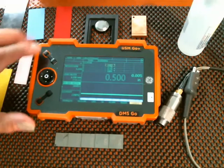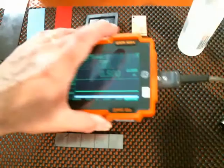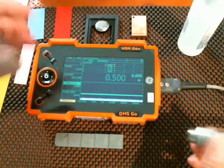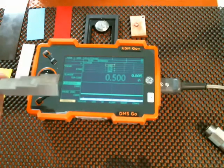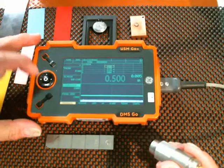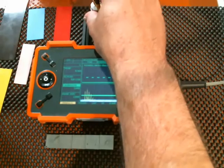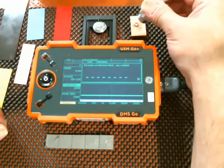At this point we are ready to connect our probe. We plug in, making sure to observe the keying on the connector, and go back to the probe and cal menu. Scroll up to calibration, and now put a drop of couplant on our blocks. I also have a standard five-step calibration block here — put a drop on my half-inch step. We're ready to begin our calibration. On the probe and cal menu, scroll to calibration, right arrow to start. The first instruction is to put the probe on the zero block — that's the one built into the kickstand — using couplant. Stay coupled, then remove the probe. Now it's time to go to the velocity reference block — that's the copper block.